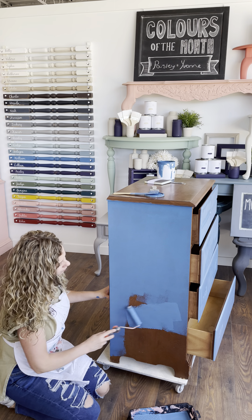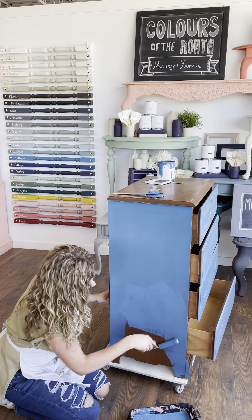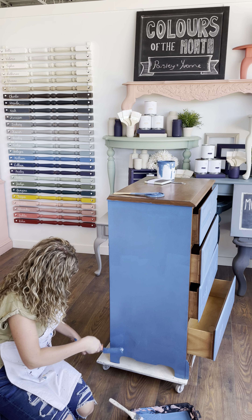Nice and light — this is the first coat, so I will do a second coat on this vibrant color. I always slow down when I get to my edges because I don't want to accidentally go over. But if I did, a damp cloth right away would take it right off. I would also use my brush down at the feet because when the roller comes up against another edge it can't quite get to the end, so I give it a brush to make sure I'm getting right to the bottom.